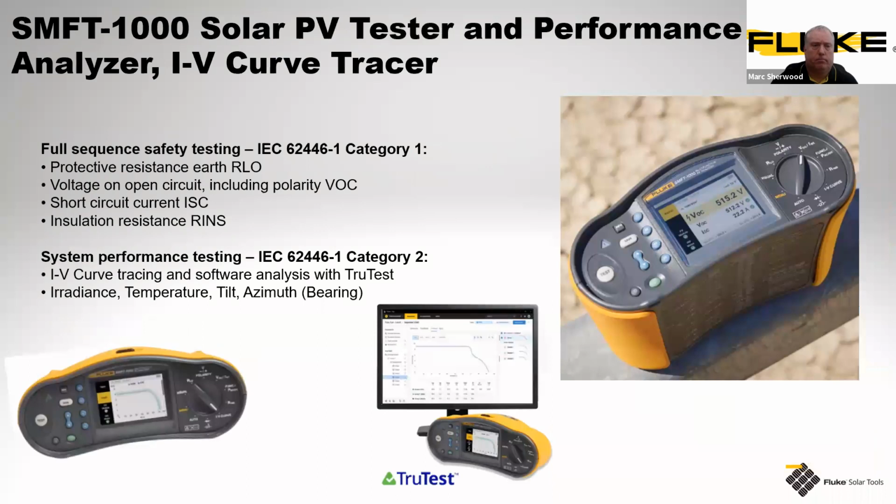So we have the SMFT-1000 solar tester, performance analyzer, and more importantly, an IV curve tracer. So what will the unit allow you to do? It will allow you to test category 1 tests in accordance with the IEC 62446-1 standard. This is where, again, apologies for being a little repetitive, it will allow you to test for protective resistances, voltage of these open circuits, including polarity, short circuit test currents, and an insulation resistance test. That is what we call the category 1 test, where you would need the SMFT.